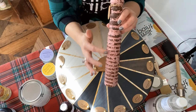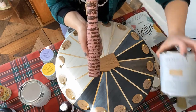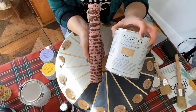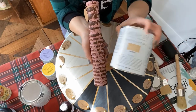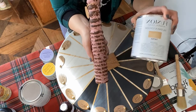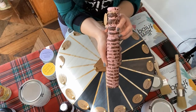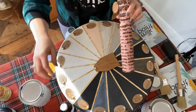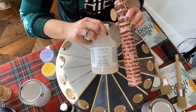But let's pretend that chippy piece was painted white — I wouldn't want to use the gel stain because it's going to amber my white chippy surface. So if we have to fix that oops, we can't use Patina gel stain because it's going to get yellowed over time. A wonderful option in this situation would be to switch to our clear Tough Coat.